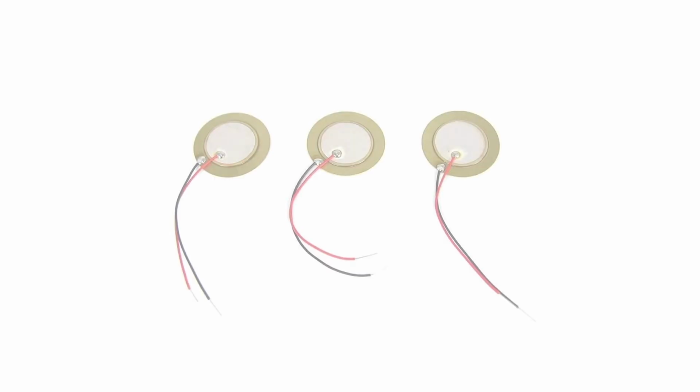This failure of the electret capsule led me to think of other means of getting electricity from sound. Piezoelectricity has been known for a pretty long time, and piezo sensors are used to pick up audio signal from guitars, other string instruments and drums. Although in a woodwind, air is resonating and not the body of the instrument. Even though a piezo pickup could be connected directly into an audio interface, especially if it has a high impedance input, I thought it's better to use a proper amplifier in this case. So now I had to make a preamplifier which fits the piezo pickup and find a way to fit said pickup inside a shakuhachi.